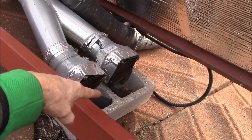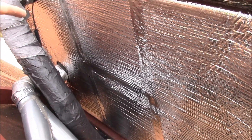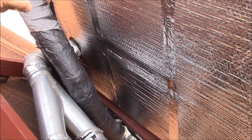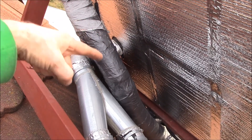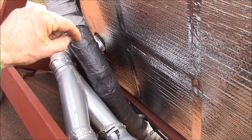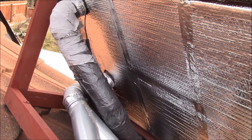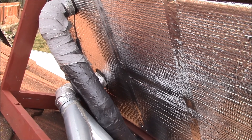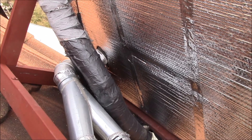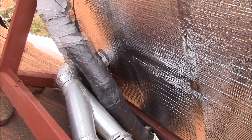I've got the two 12-volt fans powered off solar, and there are two bi-metallic thermostat switches in each panel wired in parallel — so if either switch closes, the fans turn on. They close at about 100°F and open at about 70°F, so as long as the air flowing through here is above 70°F the fans stay on.